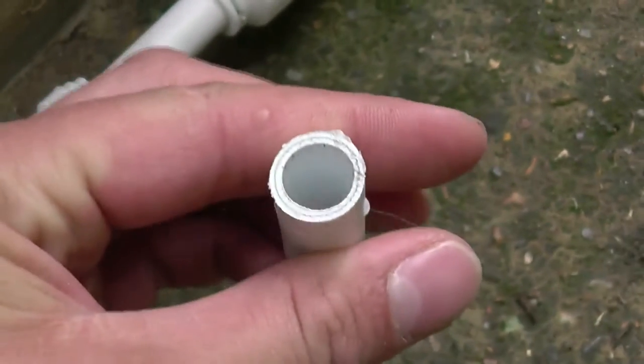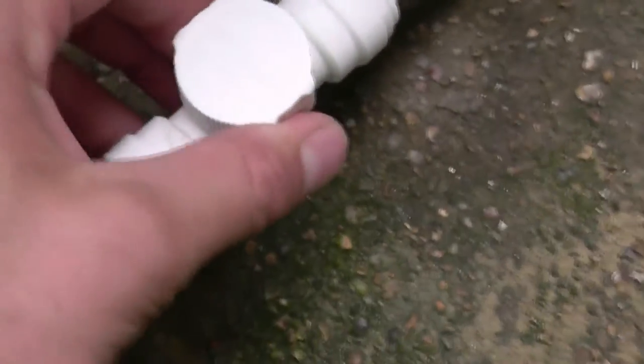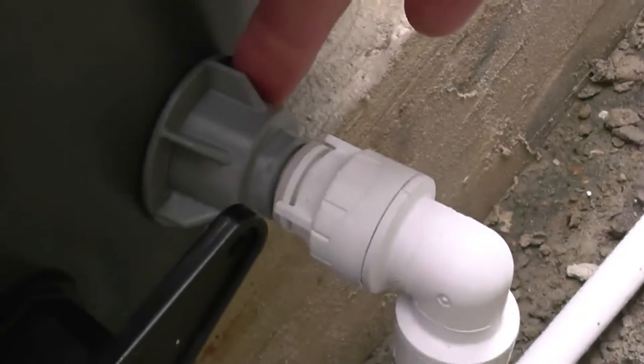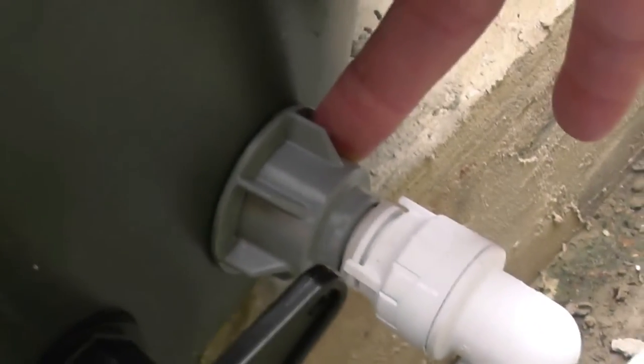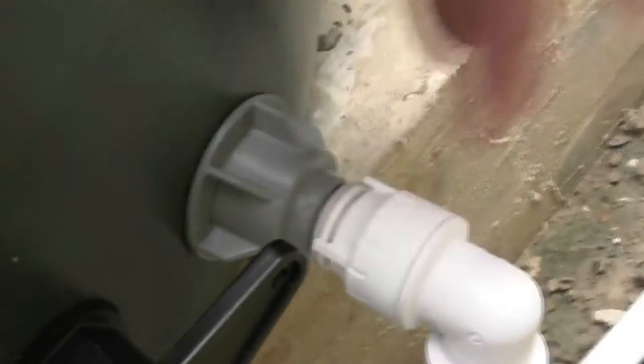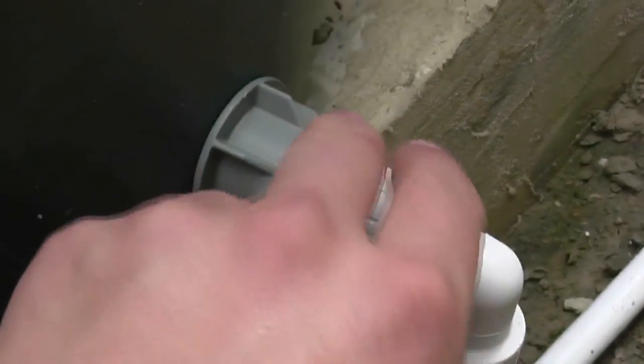What I've been using is poly pipe, which is a plastic pipe that can be used for heating and mains drinking water. And it's speed-fit — I can't remember the exact name — but it just pushes together using little inserts if you have to. And these are tank connectors, normally for your cold water supply tank. If you've got a specific central heating system where you've got a hot water cylinder, you have a tank up in the roof filling it back up, and it will come in here. So I've just got a couple of tank connectors to join them together.